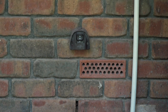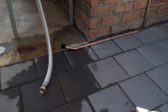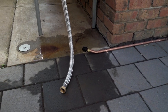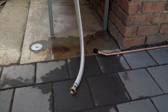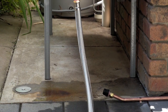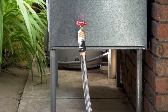Select a site near to an outdoor weather-rated power point and make sure there is a firm, flat surface on which to mount the pump, like a concrete pad or pump cover base. For added security, the pump can be secured to the base, however in most installations this is not necessary. Grundfos recommends using flexible pipe work from the water source to the pump and from the pump to the house or application. Wherever practical, install the pump as close to the water source as possible.